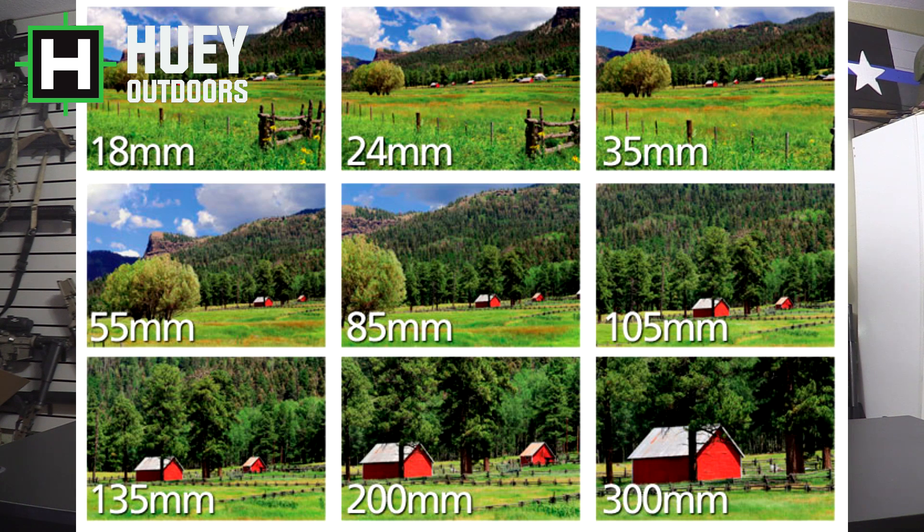Well, with the 640 you're basically getting an extra scope in there. You have that wide field of view with higher resolution. On thermal scopes, it's not like a variable power day optic where you adjust the lens for magnification. It's a camera that sees radiation — all it is is a digital camera that projects the image to a screen that you're looking at with your eyeball. When you magnify it, you're zooming in on the screen, so you're losing resolution.